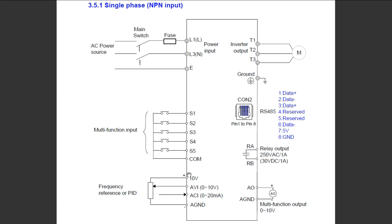The port provides 10 volts and analog ground. The wiper feeds into AVI — analog voltage input — from 0 to 10 volts, so we could vary the external pot to control a motor from stop to full speed. We could also use a 0 to 20 milliamp loop, labeled ACI — analog current input. This is very versatile; running on a 32-bit microcontroller, there are lots of options to this variable frequency drive.